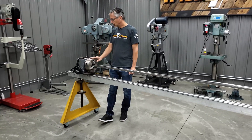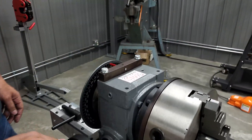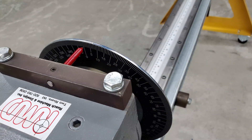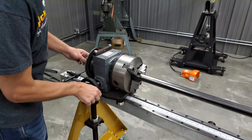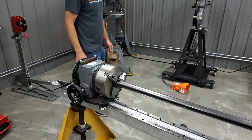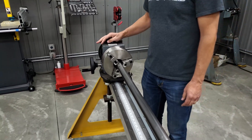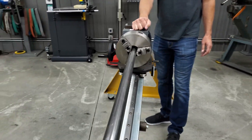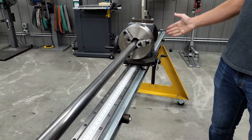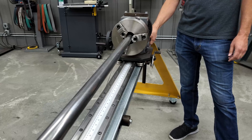On the positioning table you also have a degree wheel here, so if you want to change your tube rotation you can crank this handle and actually read the scale to see how many degrees of rotation you want to go. 90 degrees is easy to track with a level, but if you need to change something 18 degrees, this is a good way to track that rotation. The other feature on the indexing table is the ability to set up hard stops, so when you slide your tube forward it goes over the bump stop, slides back, and comes to a hard stop. That helps you to get your length between bends. There's a scale on the back with a mark so you can read that as a reference.